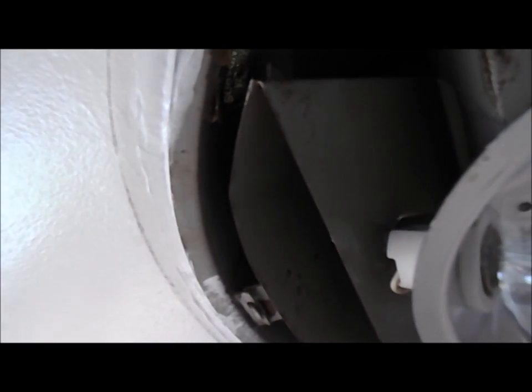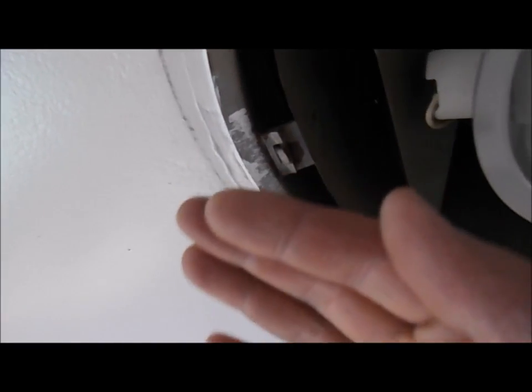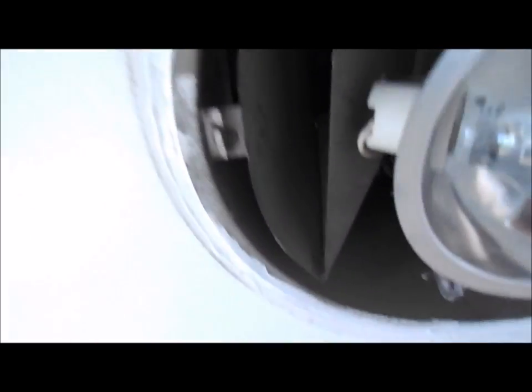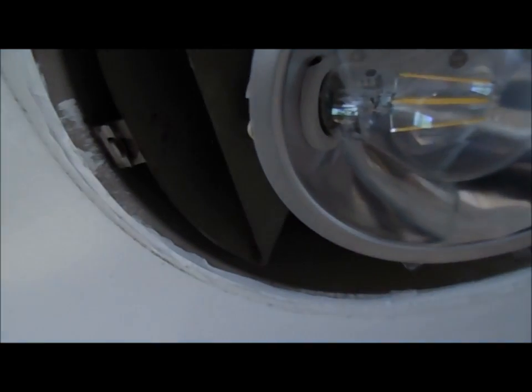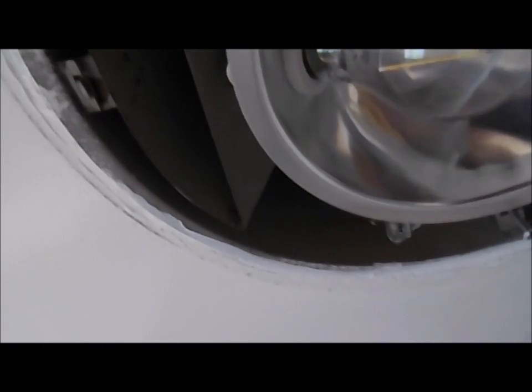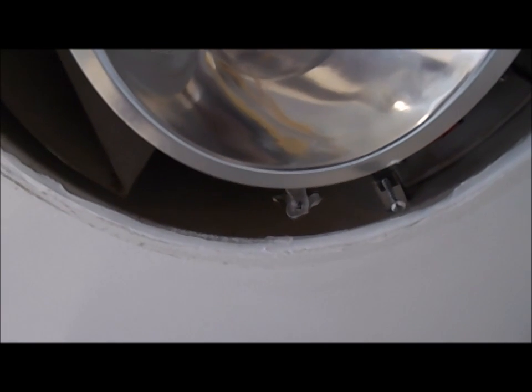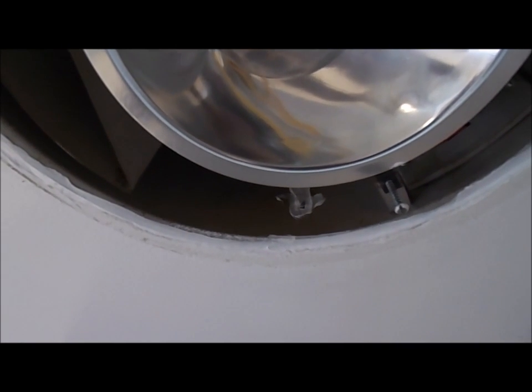I'll leave that on, we'll check the roof. And then when I turn on the heat, you hear that damper door change. Now the wind is blowing out here and this is warm, and the heating elements up there are getting warm. So it should be working. Now it's just venting. That's the light. So it's definitely loud, but at least it'll be working now. Alright, so let's get the cover back on and I'll turn it on and take a trip out to the roof.